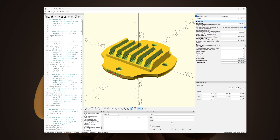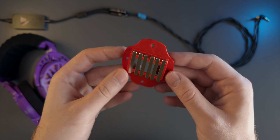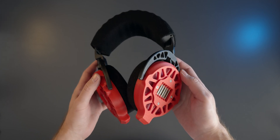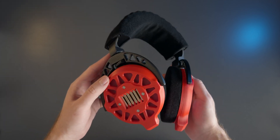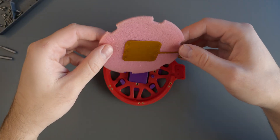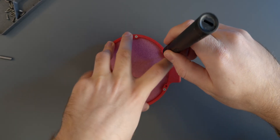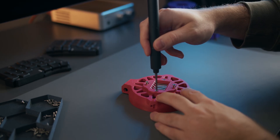It also opens up the back of the headphones even more and exposes the magnet array from the outside, giving the headphones an entirely new look. Reassembling the headphones with the new printed parts is pretty easy but it's important to remember to use the driver mounting jig to support the foam and driver assembly before adding the inner ring. An added benefit of using heat set inserts everywhere is that you get to use fancy screws like the Torx head screws I used for the magnet holder.